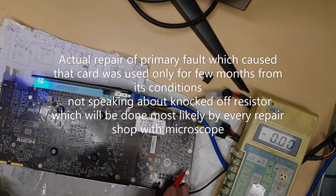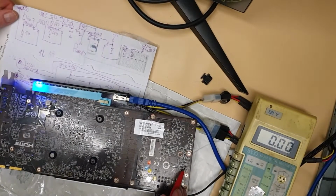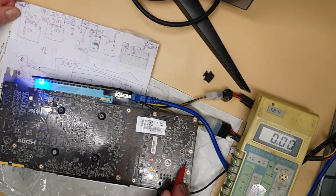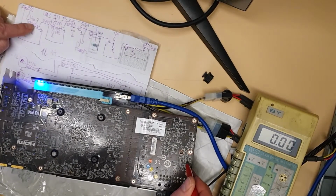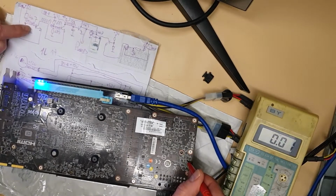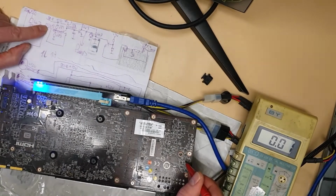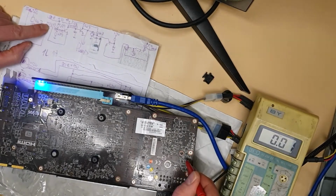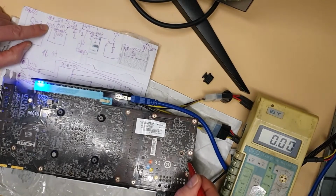So basically plus 12 volt is coming, you can see it here, first divider here, plus 12, and on the base, see, now we got 0.67. You see, now we got 10 millivolts basically here, shorted. So basically it's this base on this transistor 0.69. So basically 0.69 here, almost 0 here. You see, if here we got 0.67, so that's the only difference.